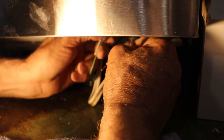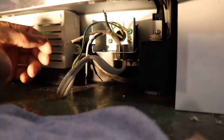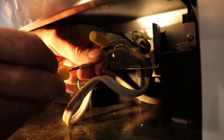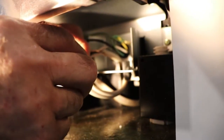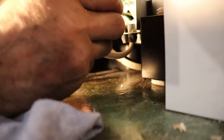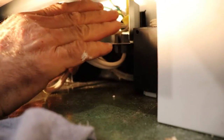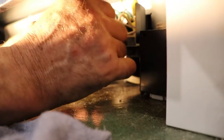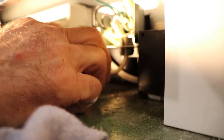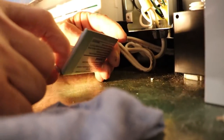The ground wire is already connected in there. We have three wires — the black is the hot wire. All we do is connect these guys together, make sure they are tight enough and secure. Then you have the white wire — nothing too crazy — and the ground wire. The green goes with the ground. I put it a little bit longer to make sure the wire goes all the way down. The neutral goes close to the ground and the hot wire on the other side — that way they never touch. This one I just tuck in. This cover has a few little clips to hold it in place.